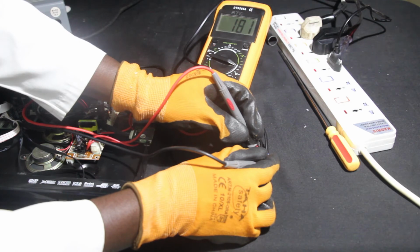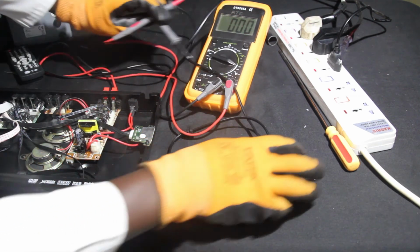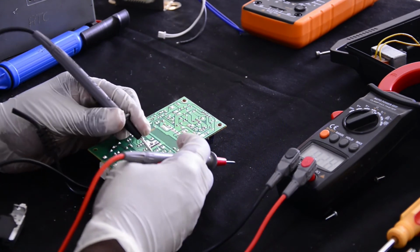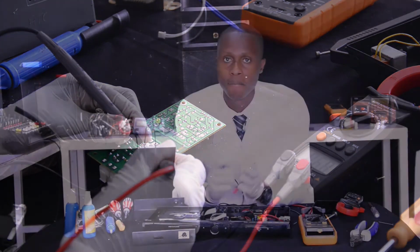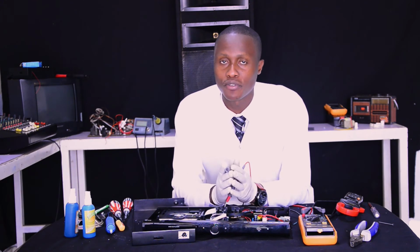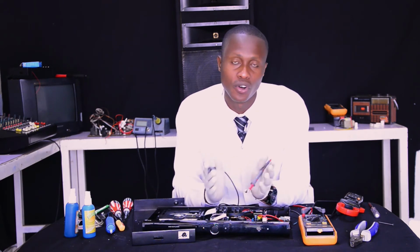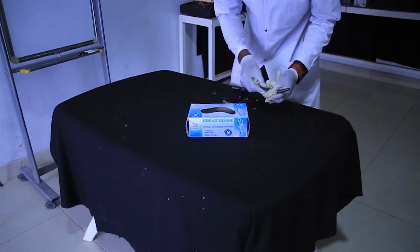It means you do a voltage measurement of the chopper transformer, of the capacitor, of the diode or rectifier, of the regulator, and finally of each resistor embedded in the circuit of this DVD power supply. When you finish the voltage measurement for each part, you do what is called assembling, which is to fix together separated pieces in order to make one whole. After that, you clean the workplace accordingly, and you manage waste materials accordingly. It means you have finished repairing a DVD player.